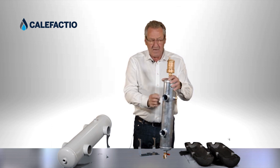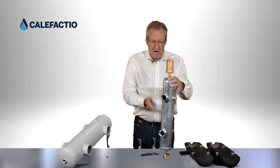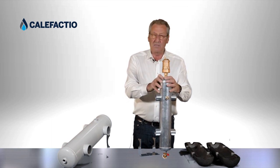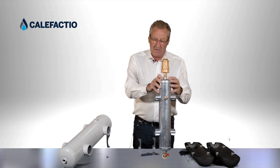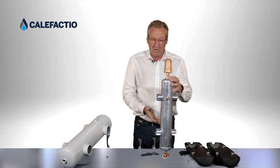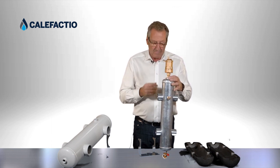There's a little screen inside. The little screen helps to separate a little bit of air and a little bit of dirt, but this is not an air and dirt separator — it's really a hydraulic separator. It will do a job of taking some air and some dirt out, but it does not replace an air separator or a dirt separator.